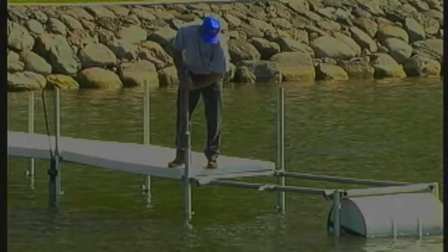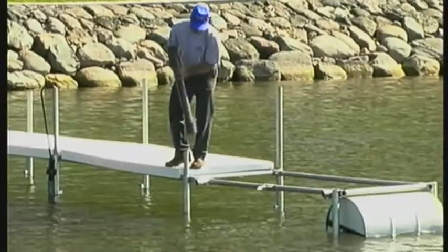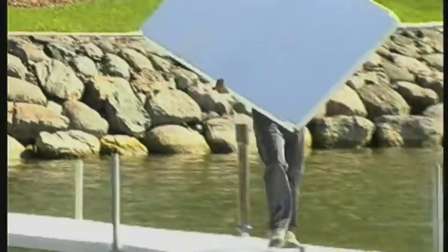To raise this section, you will hook the jack on the barrel clip instead of the frame. That should give you enough height, but if it doesn't, then wait until you pound the post for the bench in and then jack that post to raise that section to its desired height. Once again, be aware of the method used to handle the deck.